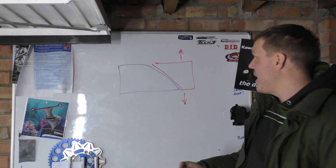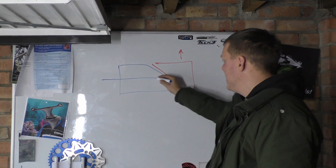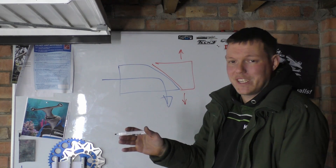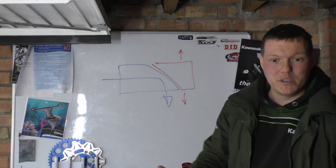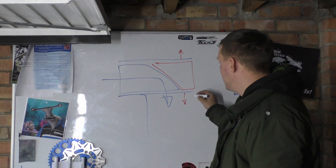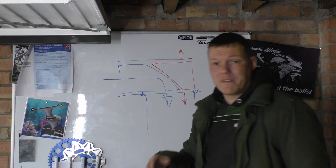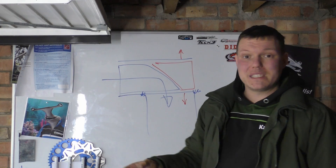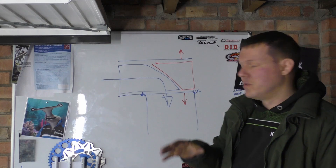Obviously this thing needs cooling, because as soon as your fuel-air mixture hits the divider and goes into your cylinder it cools the inner surface — which is good, but it also causes the thing to contract. This contraction and wobbling means the whole thing has to be sealed, otherwise during compression it's going to leak. It's a rotating sleeve — it has to seal here, here, and here. Nowadays we slap a big gasket in there and clamp the hell out of it, and even then gaskets can fail, your compression drops and your power drops. The problem is thermodynamic and material.